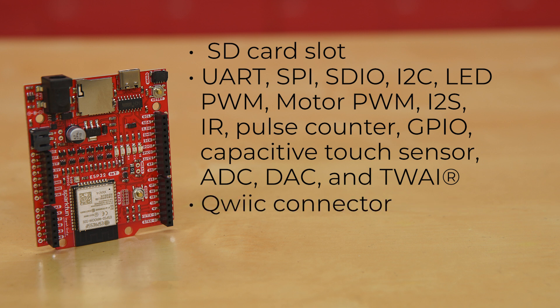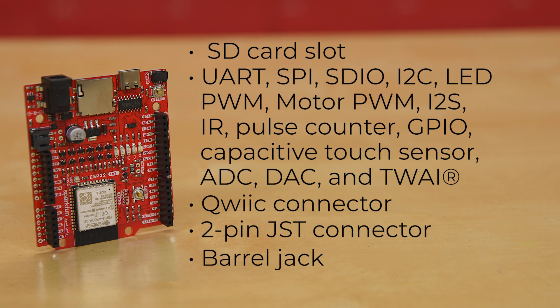Of course, there's a quick connector, and since we've done a little tweaking to allow for low power applications, there's now a two-pin JST connector for single-cell LiPo battery power, in addition to the barrel jack we're all used to. Connected power, programming, and USB to serial is now done with a reversible USB-C connector with through-hole anchoring and the ubiquitous CH340G, requiring fewer driver installs.